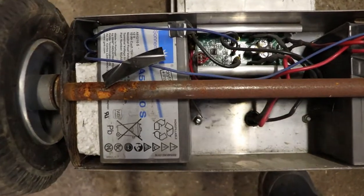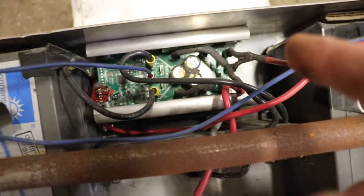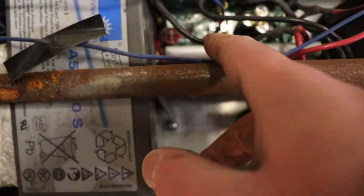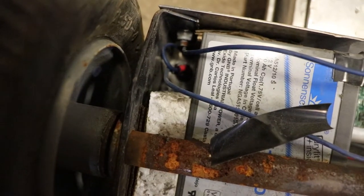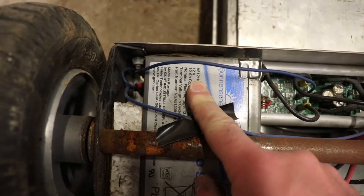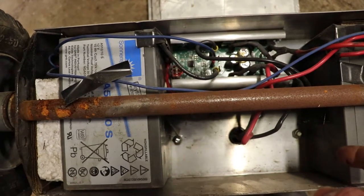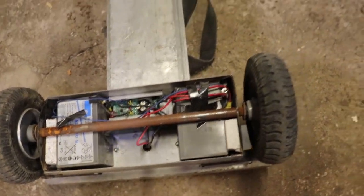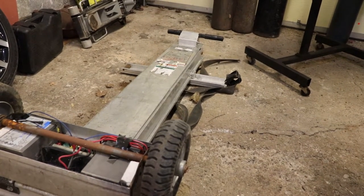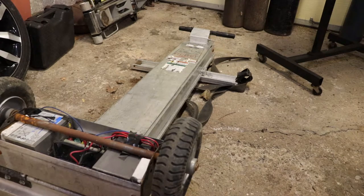This is the inside of the unit. You can see there's a circuit board with the battery positive and negative marked. The positive side is over here and the negative side is over here. This machine runs a 12-volt charger, so the batteries will be wired accordingly. They're shimmed with a bit of foam, same as described in the parts documentation. You just pull a cotter pin on one side — these have greasable axles — then knock the wheel off with a hammer to get to the battery.